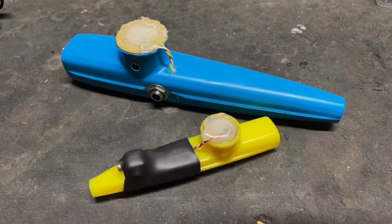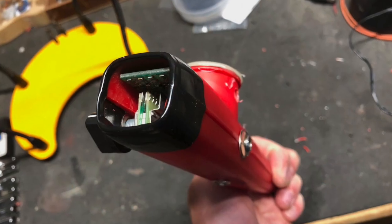Next one, the Psycho Knob Kazoo. This was a project where I ended up having to do two different takes to get it right — watch that video if you're curious because there's a lot of information in there. I'm happy with the way it came out considering how ridiculous the idea was, but that's just it — it's still a ridiculous idea. An electric kazoo is not necessarily a bad idea, but why does it need a built-in preamp? What happens is you get distortion in the preamp of the kazoo itself, which makes it harder to control, and you get a lot more feedback because your sound waves come back right into the kazoo — this is a feedback monster. If you just use a passive setup and add the distortion at the amp or at the recorder, you get a much better effect. So this didn't end up being very musically useful, but I was glad I did it because I had a completely failed attempt before I got to the right one.